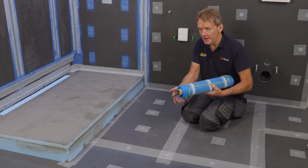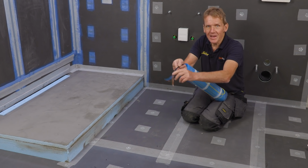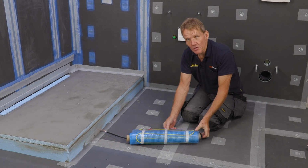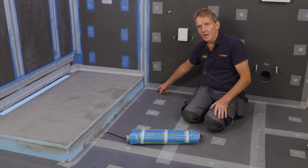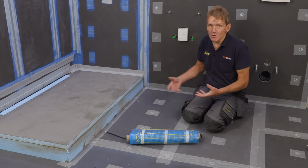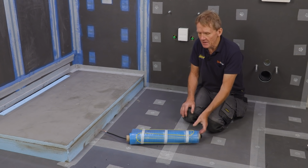Now, when you're laying it, you need to work out where your supply is coming from, which will be outside the room. That's where it will link in, and then you'll put the thermostat on there. You also put an under-tile probe into the floor so that you can measure the temperature, keep the thing regulated, and avoid putting it underneath basins and a WC and places like that where you're not going to stand, because it's a waste, and sometimes when people put a pan over the top of it, it just cooks in that spot. So keep it where you need it and just work it out.